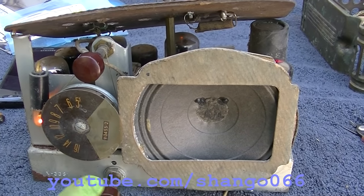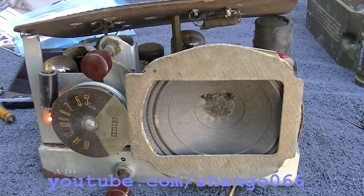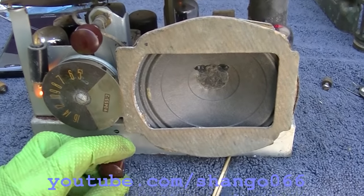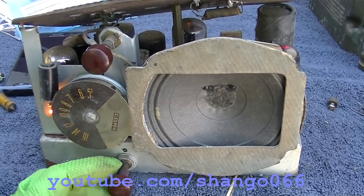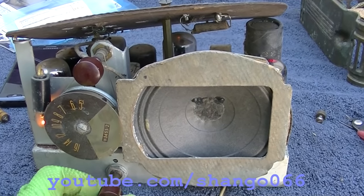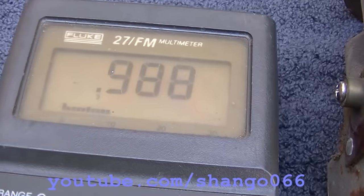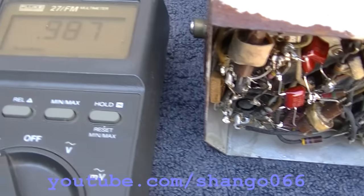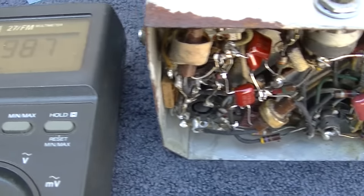This is actually like decent — this is about the last thing I can actually listen to on the radio, which is really freaking sad. It doesn't really need to be aligned, but I can hear KNX overlapping Radio Disney a little bit, so the IF needs to be tightened up. This audio output tube has a grid leakage of about 0.9 — this is the one out of the other radio. It seems to be getting better but I need to find another audio output tube and a power cord.